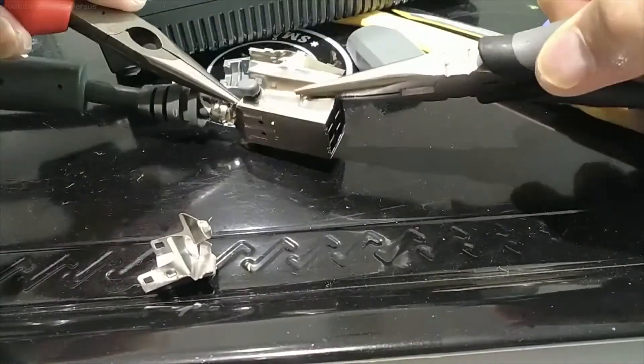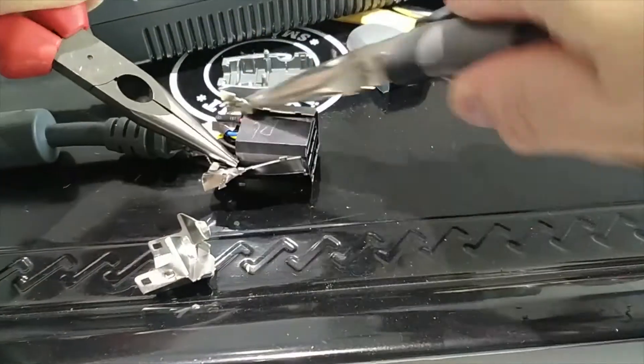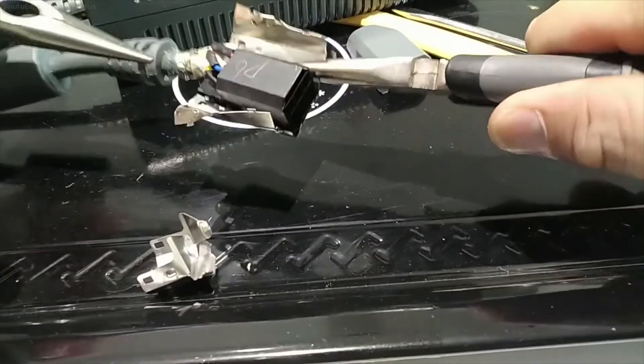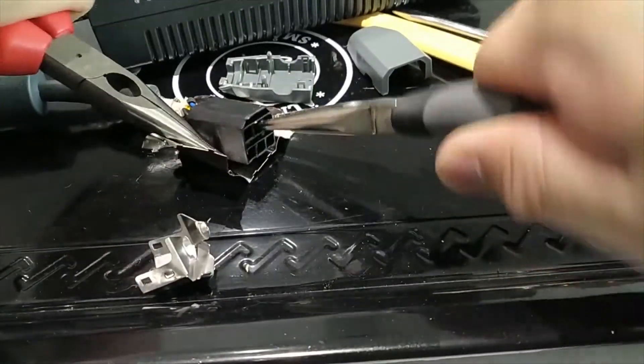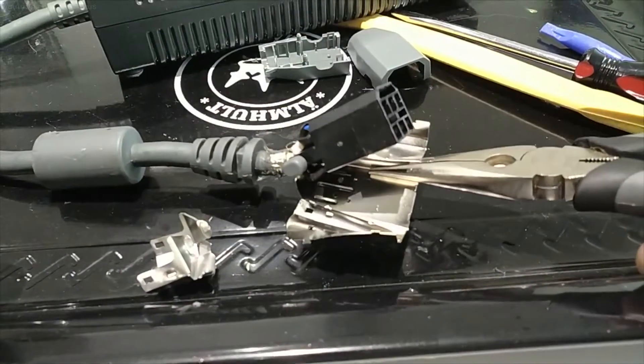You can cut it with a pair of pliers before the connector, but that way the wires are a little bit shorter. I wanted the wires to be longer to get as much length as possible, making it easier to solder them to the XT60 connector. This does require a little bit more work, but I think you're better off this way.